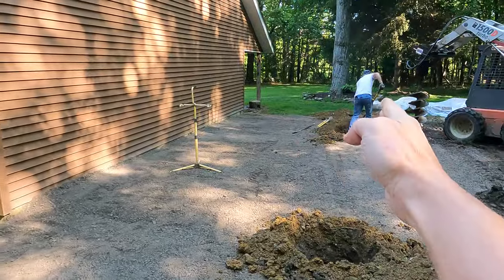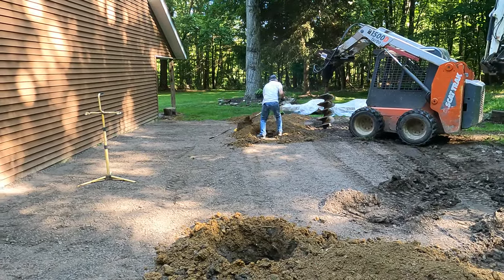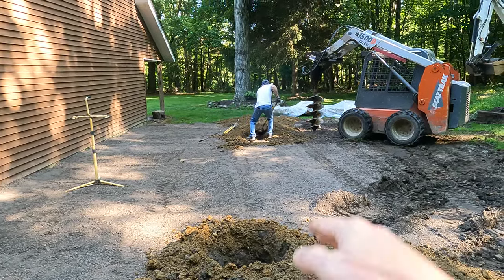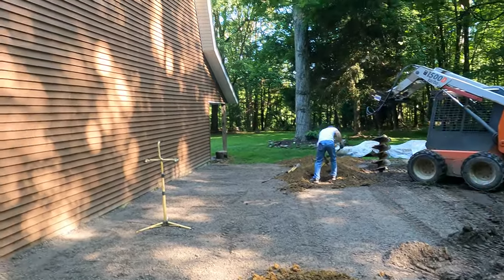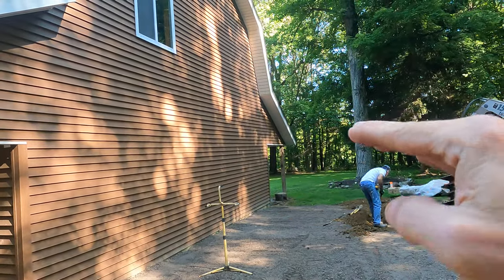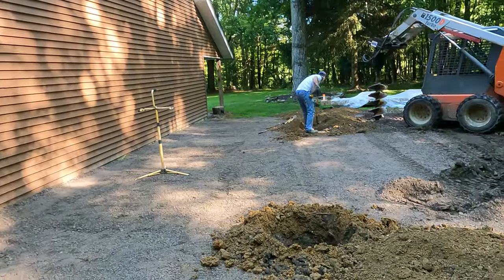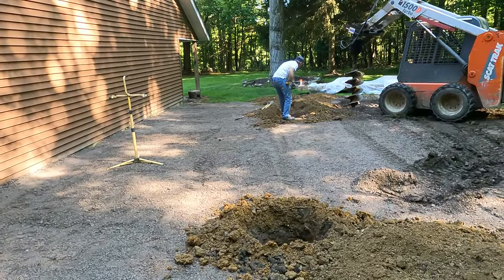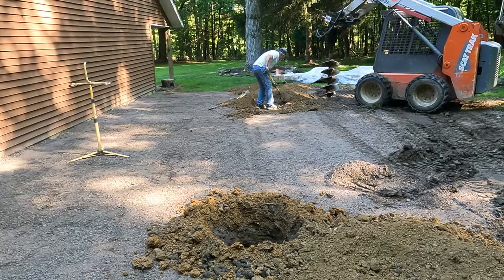That's gonna go straight across here on three posts. The posts are gonna be 2 6x6s screwed together. The beam will go across and then trusses will go up to the building, to right about the bottom of the window there. So it's gonna slope out. And then on the edge here, we're gonna come down this way. So should be interesting. I'll probably use a lot of speeded up footage as we're doing this.